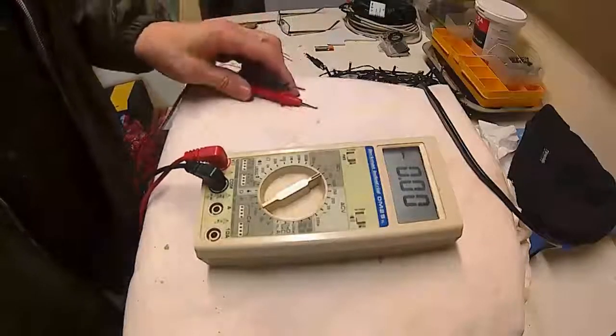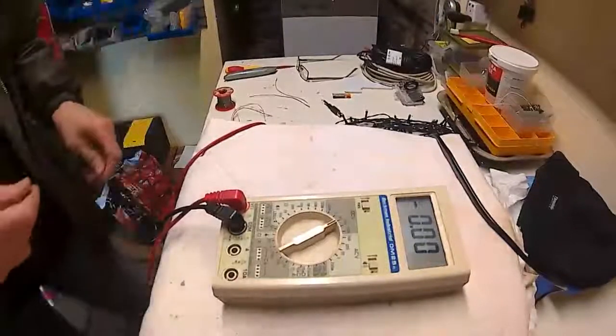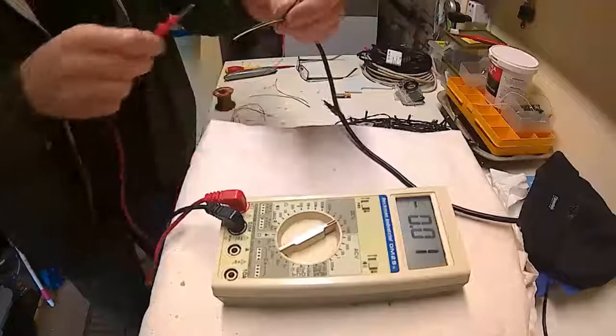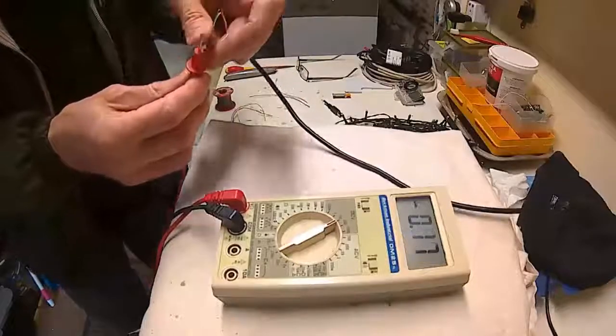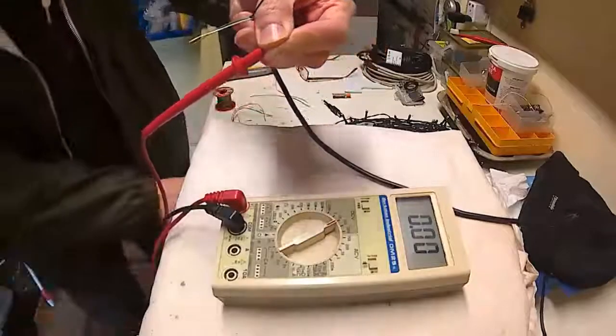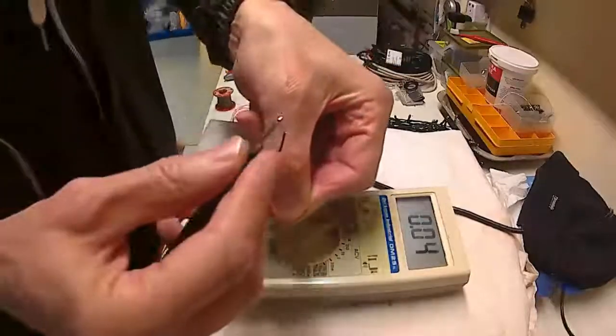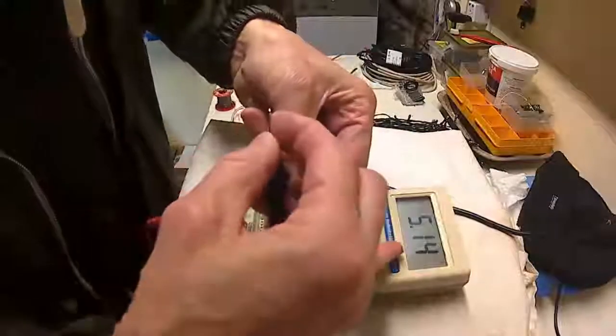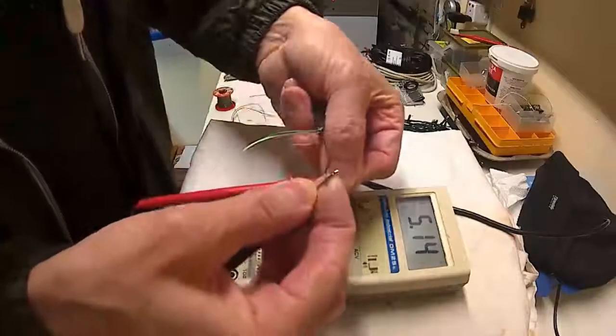What I'm going to do is show you how we could connect these to a USB — this is how I did it and it worked well. First I find an old cable, cut the wires, strip them back and measure the voltage — I'm getting 5.14 volts. A bit higher than four and a half but by the time it's loaded up it'll be perfect.